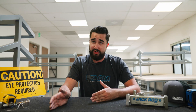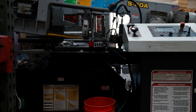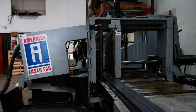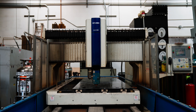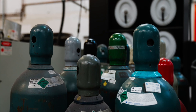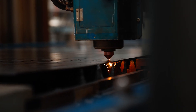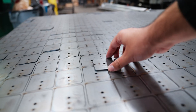Once we were through a few revisions and the engineering side was done, the product begins life as raw metal, and that metal needs to be cut. This happens on a band saw for the inner and outer shaft pieces. The saw cuts four sticks of metal at a time and automatically moves the metal to the length that needs to be cut. But my favorite cutting process is with lasers — there's lasers, dude. It's extremely efficient and fast to cut this amount of metal into very specific shapes.